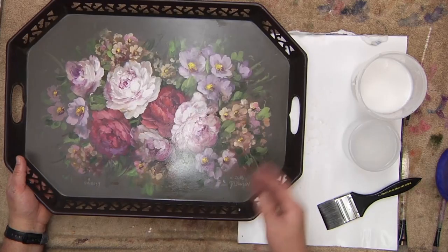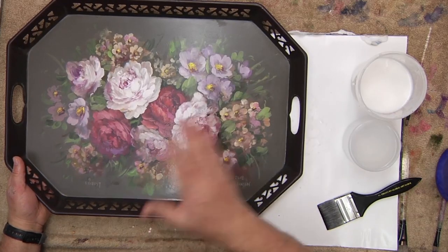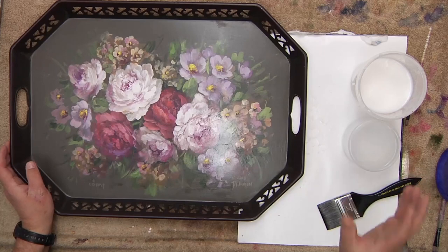And all you have to do is just go right back through it. Take off some of the excess and go right back through it. Keep a little moisture in your brush, just a little bit. Use a little spray bottle around. Don't add too much water, though, because water thins it out. And water thins it out so much you thin out the glue and you're making weak varnish.